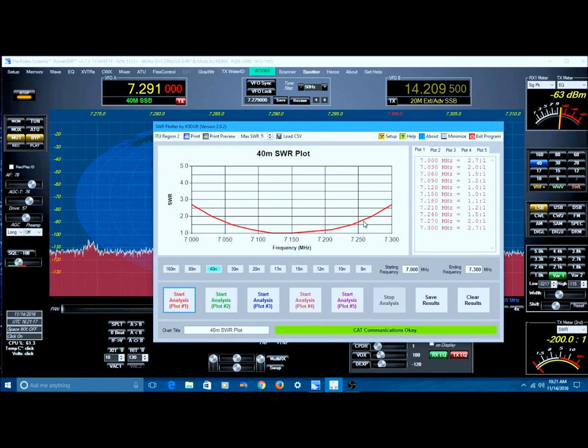Or you won't get the full power out of your radio. And actually, if you were well down in the band, you might actually hurt the transceiver. We're getting pretty close to 3 to 1 over here. If you were working right off the bottom of the band near 7.0, you may overheat those finals, especially if you're working CW and keying down a lot, or running some kind of digital signal at that particular frequency.